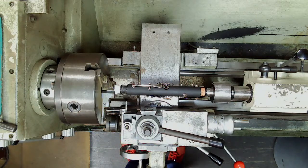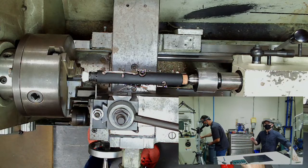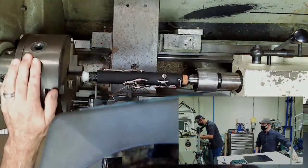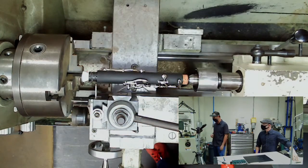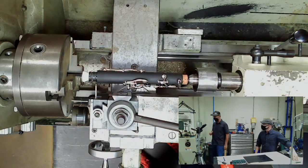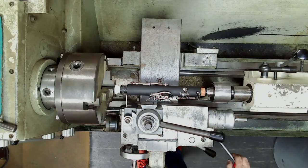I'm going to put on my optivisor — a little magnifier — so I can see what's going on. You're also going to spin that clarinet joint with a Delrin clarinet bench peg chucked into the lathe. You can use Delrin — that's what I usually use because it's what I have on hand, but a metal one works too. I'll get this as close as possible before I start, then turn the lathe on and take a little bit of material off.